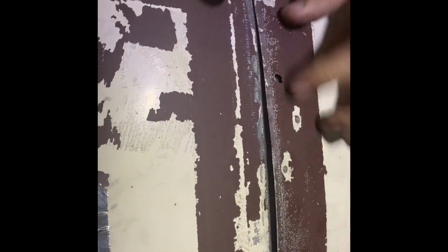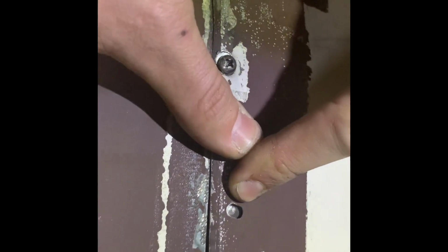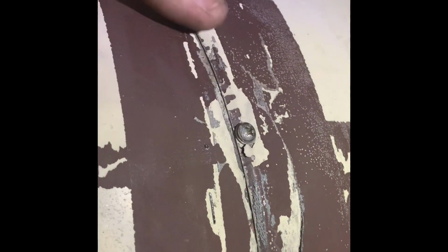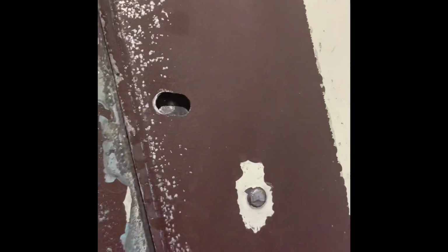So the fix, that's what the duct tape was for. Screws, and the screws pulled through, and then he just taped over it. No, that rivet's fine right there. That's perfect. And some of them he couldn't drill out, so he left them like that. Hey, it's gonna be covered with tape. Ooh, that's sheet metal cracking out. He didn't stop drill that. He just taped it. But he drilled all the way here, down to here, and then he didn't stop drill the crack.